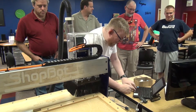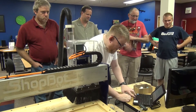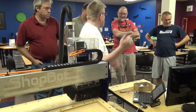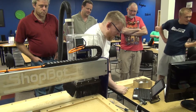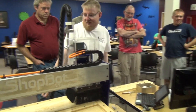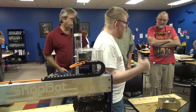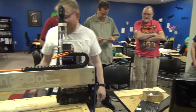Two card holders in there. It warns me about the tool number. I have changed it, so yes it is the right bit. It asks if the Z-axis is zeroed. Press the start button. Generally if it's been on it stays on as a relay, but I like to be careful — I broke a bit one time, so I'm fairly cautious.